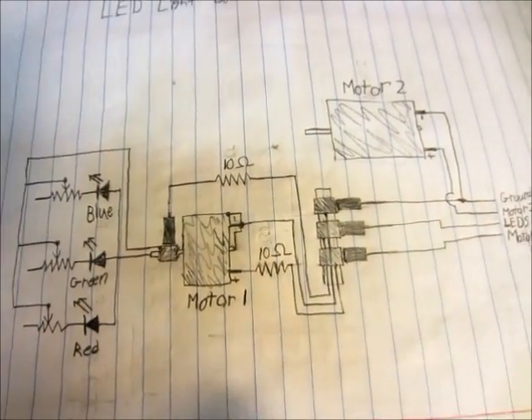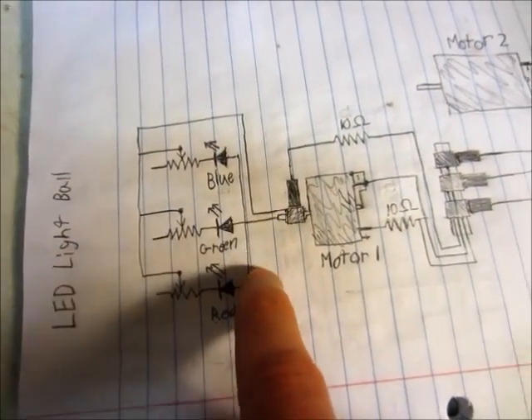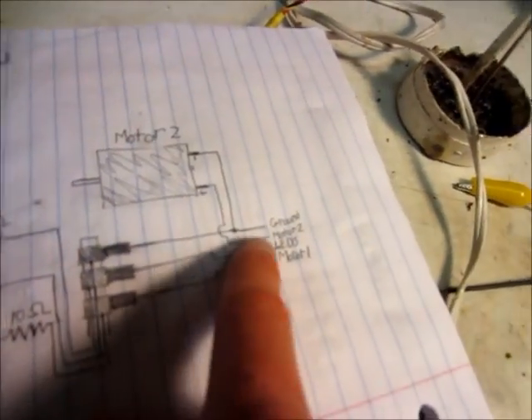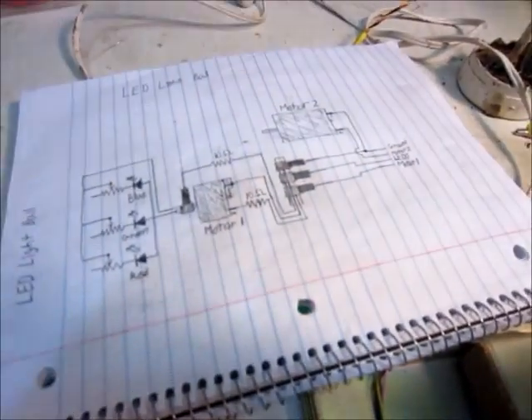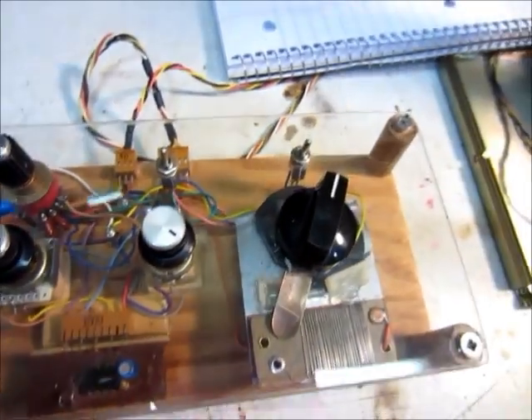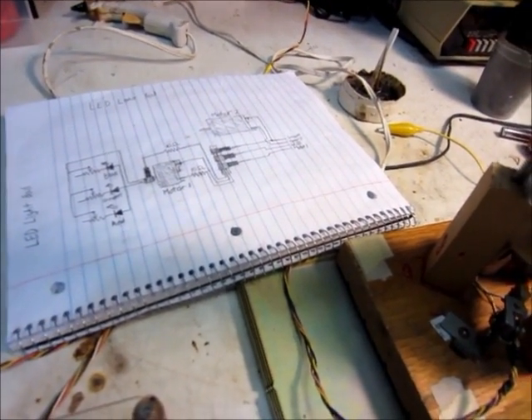The video is probably already too long, but here's the schematic I drew up. We've got the three LEDs and the three potentiometers, all connected together. The negative is connected to the motor shaft, and the positive is connected to the slip ring. We've got two 10-ohm resistors and three slip rings - that's probably the hardest part to build unless you have one salvaged from a VCR, which is very nice. Then we've got the main motor and four wires going to the control panel. I hope this helped a lot. I hope to see you in the next video - part two, the control panel, hopefully coming out soon. If you have any questions, just put them in the comment box. Thanks for watching.